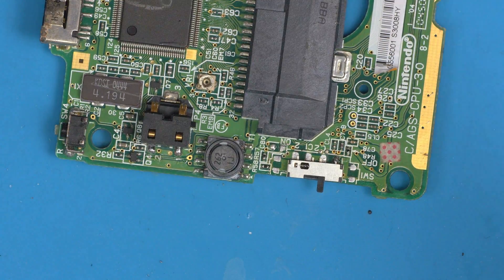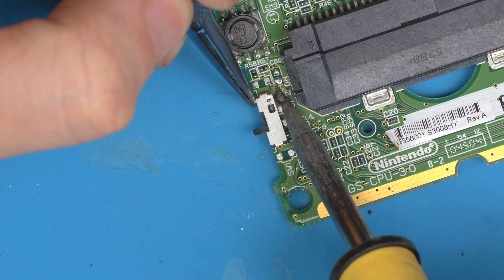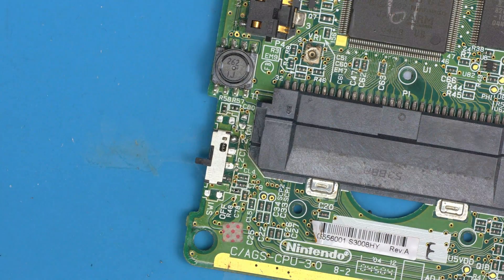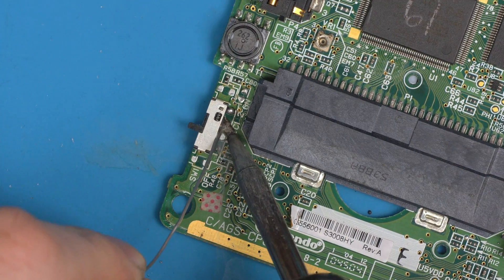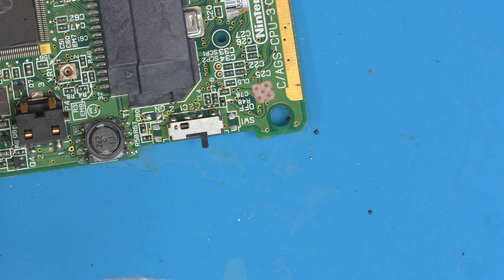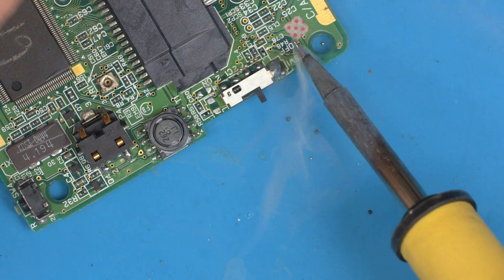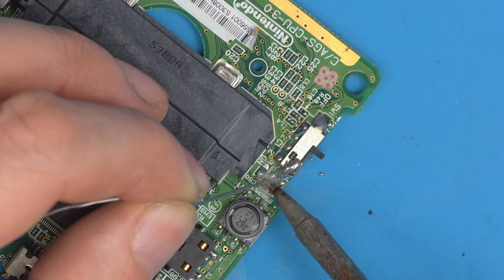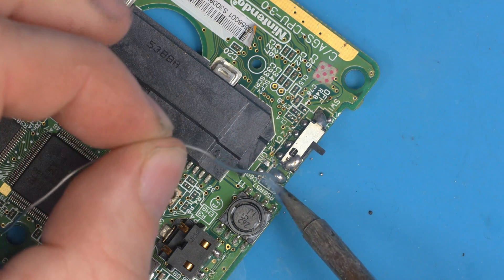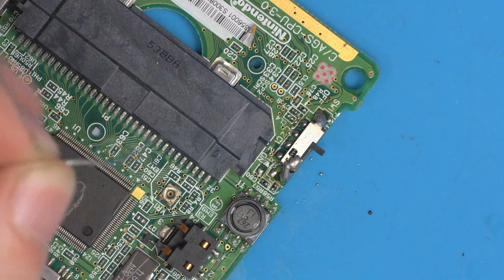Position the switch — don't go too far inward or it becomes hard to solder the contact points. Solder the remaining four pins. On the SP, pin 2 solders to pin 2, pin 1 to pin 1, then you've got common 1 and 2 which are shorted together anyway, and they align pretty much perfectly so we solder them all on. For securing to the shell, plenty of solder on the pad and it jumps over easily. Be careful not to touch the shield first — it'll start wicking up there and cover the hole while warming up the metal and plastic.